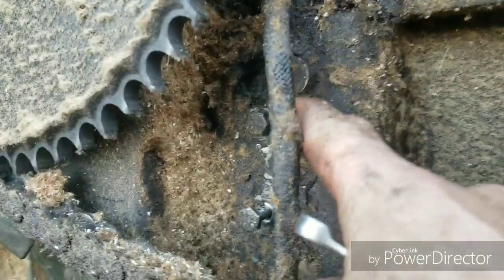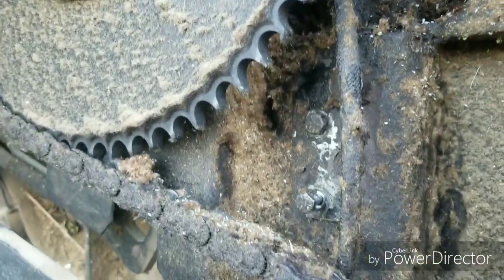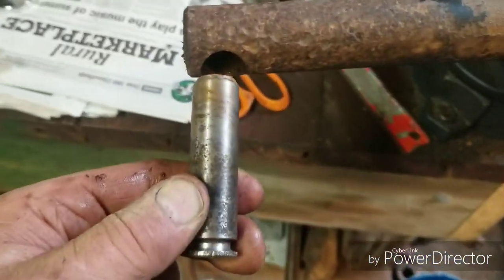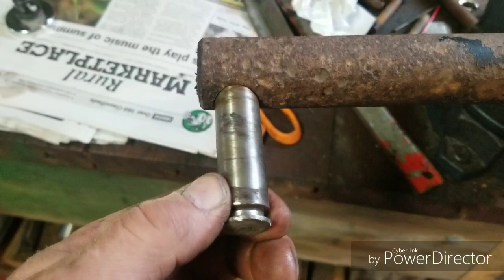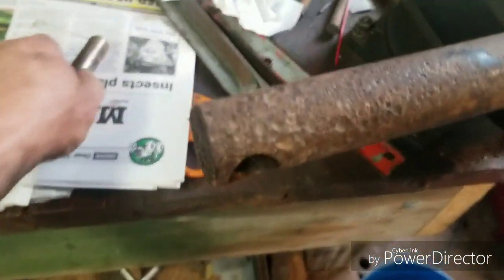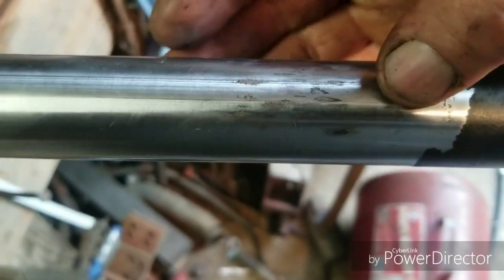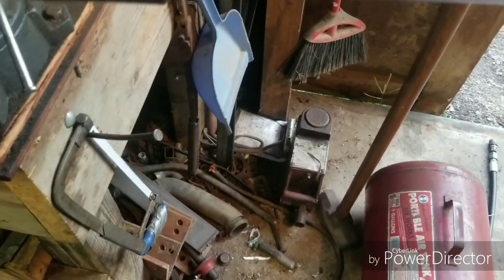Let me pull that pin out — there's a pin right there in the bottom of that cylinder — and then we'll get the cylinder out and get it up in the vise. Alright, we got the cylinder out. It was quite frozen on the bottom; I chucked it in the lathe and took sandpaper to it, polished it up, and cleaned this groove up. You can see where we grabbed it with a vise grip. This cylinder has some scores in the chrome rod — I don't know if that'll clean up or not. We're going to chuck it in the lathe and polish it as best we can, but first we're going to get it apart.